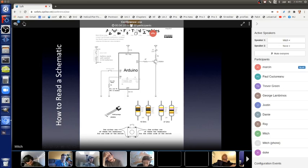The other side of the 10 ohm resistor goes to one side of our infrared IR LED. There's two sides. One side's plus and one's minus. Do you remember which side's minus and which is plus? Big side's plus. Yeah, so the arrow points down in this case to the minus side, and there's a minus sign built into the electronic symbol. So the bottom in this case is minus. The 10 ohm resistor goes to the short lead of the infrared LED, and the long plus lead goes directly to the red lead of the power supply through the power solderless breadboard.